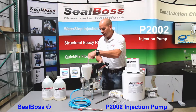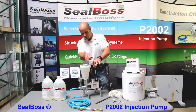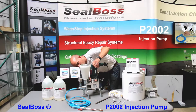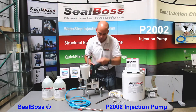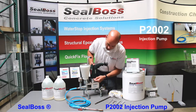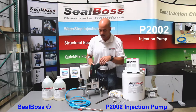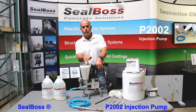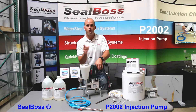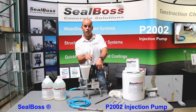The pump is a drill-driven pump. You have a Metabo drill that fits very snugly inside of this collar. One key is you're going to want to make sure that you seat that drill absolutely flush and down deep enough so that there's no gap between the top of the collar and the actual green on the drill — make sure that that's nice and tight. As you start to pull the trigger on the drill, you'll see this piston down here start to move back and forth rapidly, with increasing speed as you pull the drill trigger even more.